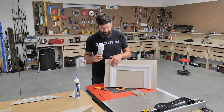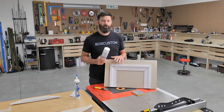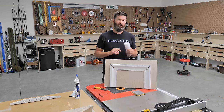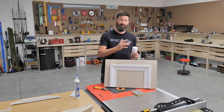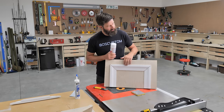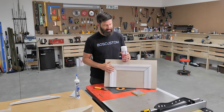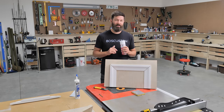If you've got a seam that doesn't have any bare wood showing, you don't really need to use the primer — it's a bit of an extra step, so you could go straight to paint in that case. But here we have a lot of bare wood showing and there was a lot of chipping, so the primer is going to be a really nice touch.